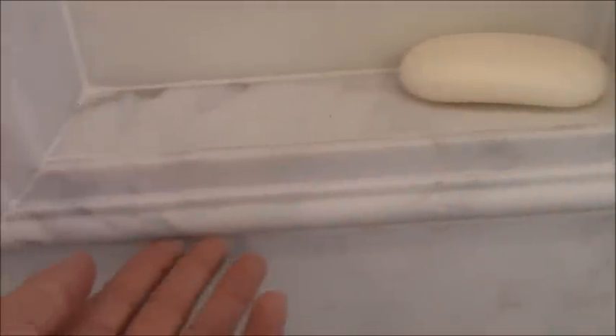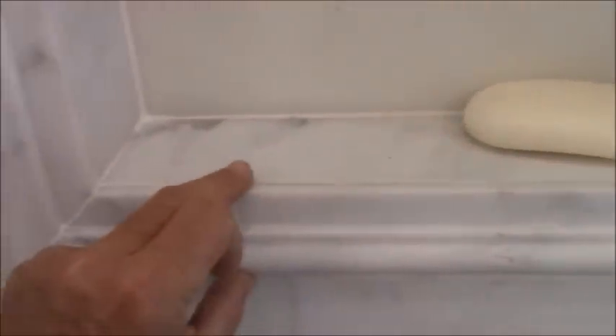There's grout missing out of here, there's grout missing inside of the niche. They used a dull blade to cut this tile because the tile was all jagged. And they didn't even center up the niche pieces — they put one straight piece here and then a couple of smaller pieces, but they didn't center. We've got a long piece and a short piece. I don't know why they're doing that.